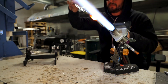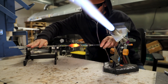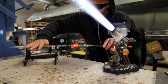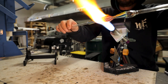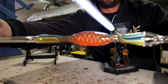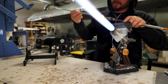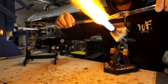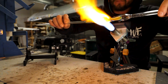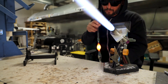Here I'm just heating the whole thing to even it out a little more, round it out in those little steps I was talking about. Make sure everything's nice and straight and your wall weight is nice and even. Here you can see the about halfway stage — nice little football shape, terminations are starting to come into the edges. Adding a little more heat and rounding this thing out, heating and puffing, evening out the wall weight, going for that finished football shape.